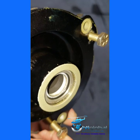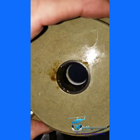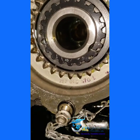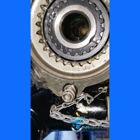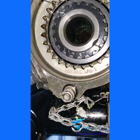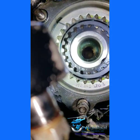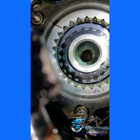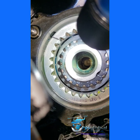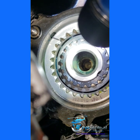Here we have the cap on the left side of the gearbox. You can see the excluder, the housing, and the bearing. Now look at the grease — it came all the way out here. Let me point it out with a flashlight. You can see all that stuff in there — that is grease, and grease mixed with oil.